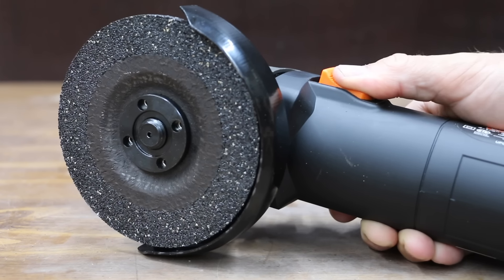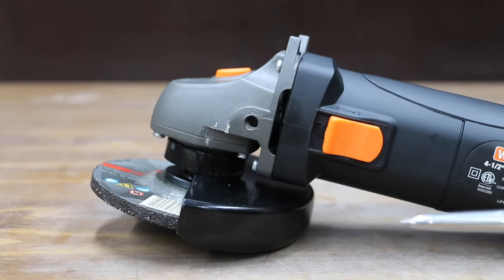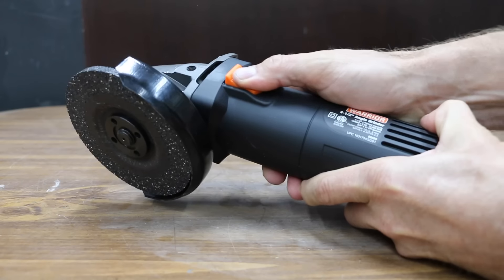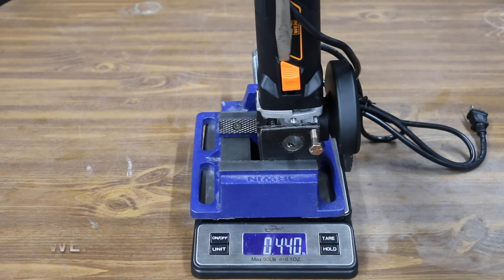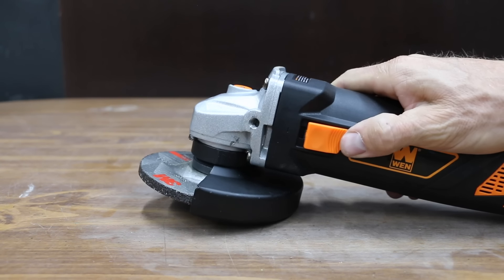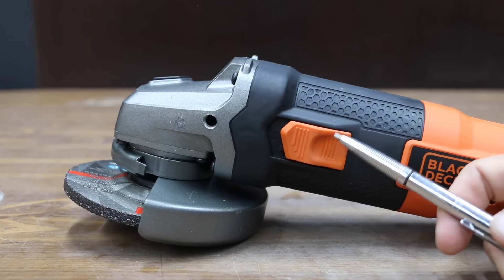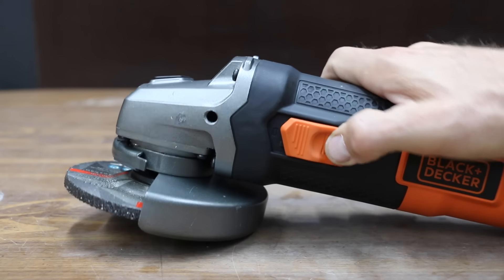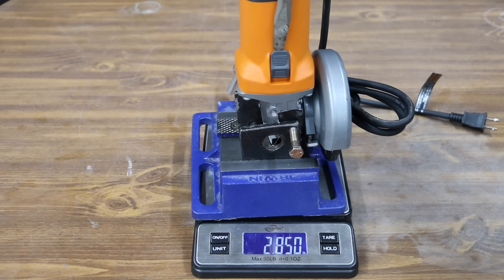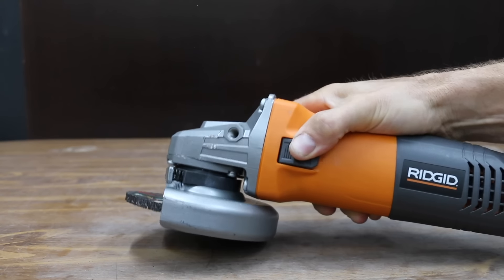If your hands are sweaty or you're wearing gloves, activating a switch can be difficult. The Warrior switch takes 10.3 pounds of force — not just pressure but ergonomics matter, as you have to push down on the bottom of the button while pushing forward and rotating to lock it on, essentially requiring two hands. The Wind takes much less force at 5.8 pounds and can be easily activated with one hand. The Black & Decker takes 6.5 pounds — the thumb cutout makes it very easy to grip even with a sweaty or dirty thumb. The Porter Cable also takes 6.5 pounds, but there isn't much of a bump-out on the switch, making it harder to activate. The Ridgid is about the same at 6.4 pounds; it has the largest barrel circumference in the lineup at 8.25 inches, but those with large hands can easily grip it one-handed.